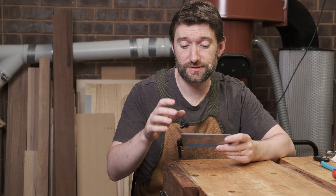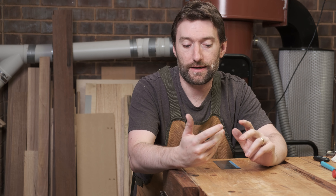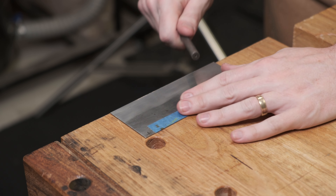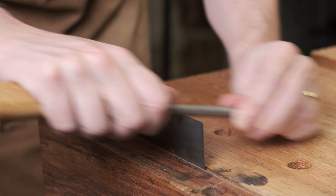Now this process might not seem particularly hard because well, it's not really — but the edges are only going to last five to ten minutes of continuous use. On a card scraper you do have four potential hooks: top, bottom, and the opposite sides of them. Don't use the short edges because you'll cut yourself. So you can make it last maybe 20 minutes, maybe even an hour. But then do you have to go through the whole process of stoning it, taking it to the water stones, filing off the burr? No — you can reset the hook by doing the whole burnishing process about four or five times before the hook becomes a little bit too brittle. At that point you'll need to go back to the stones, and to do that you just treat it like it was straight off the stones — take the burnishing rod on both sides and mushroom over the edge again, then turn that hook.